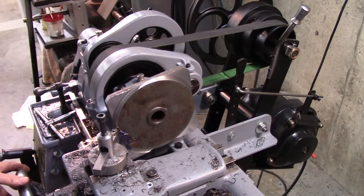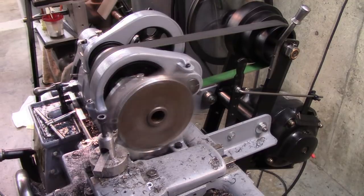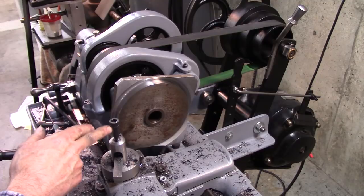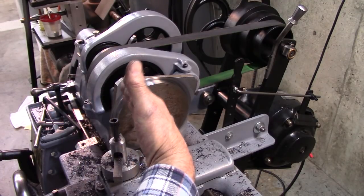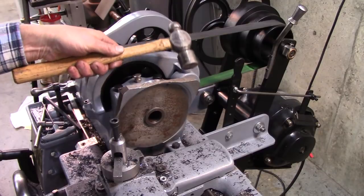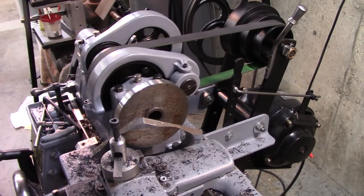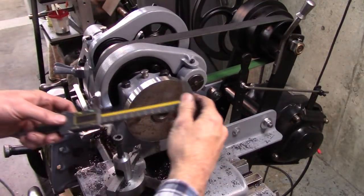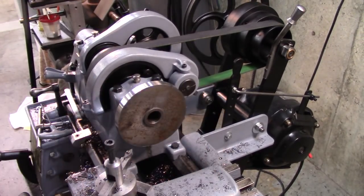Okay — this is how not to make a faceplate. Really I should have had a bandsaw and cut that at least into a rough circle before I trued it up. There's also a way to use a trepanning tool — I think that's what they call it — which has got a curved bottom to it, kind of like a cut from a piece of pipe. But I did manage to get through this. What a pain in the neck. Broke a couple of inserts — it's not a good way to do that. Still quite a ways to go yet.